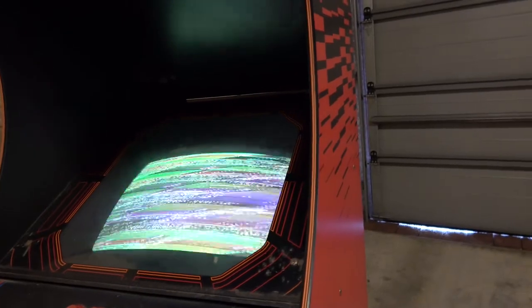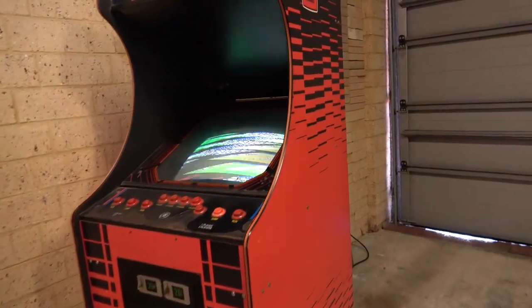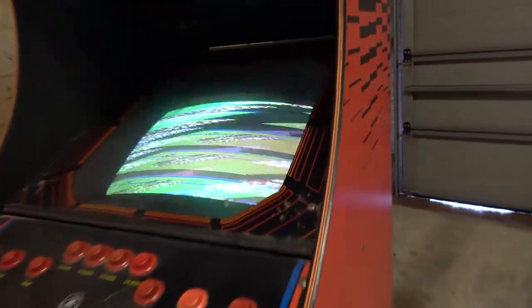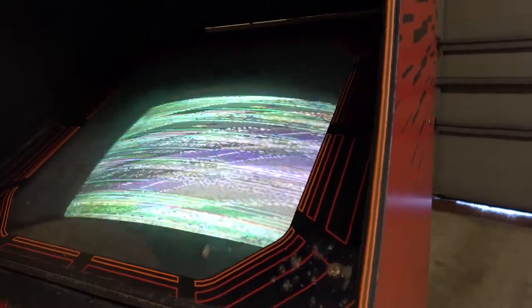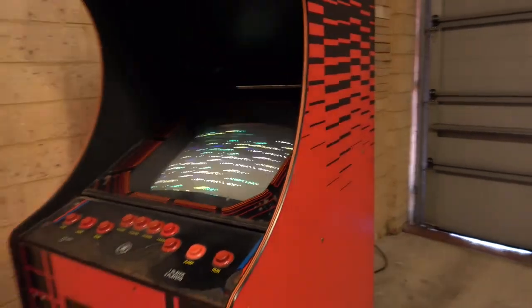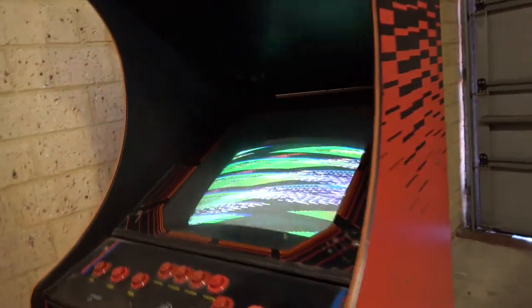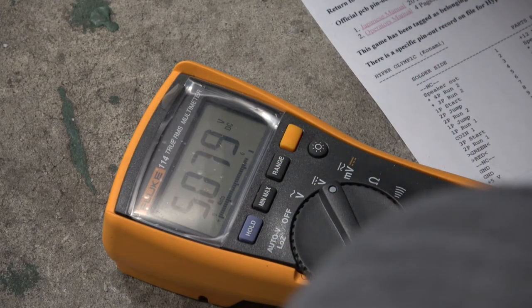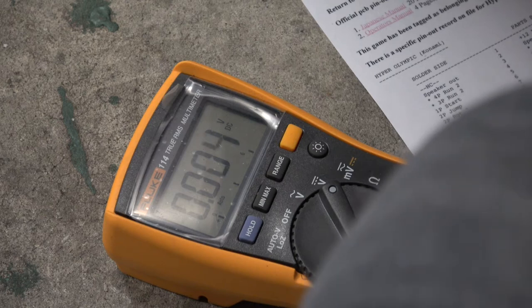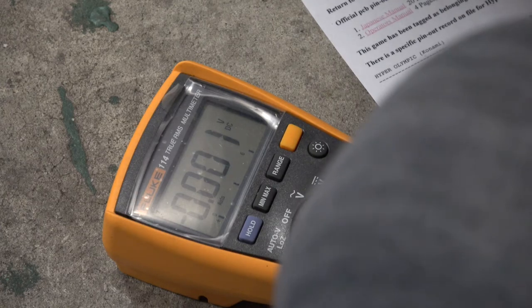The result is still looking the same. I've adjusted the horizontal hold to try and adjust that out but it's not adjusting out. I'll just check what voltage it's getting. The edge connector is a little crusty on the plus five, so maybe it's actually being overdriven. I got the multimeter and it's dead on five volts — so there's no voltage issue going to the board, that's all good, although I am a little concerned about why it's crusty on the edge connector.